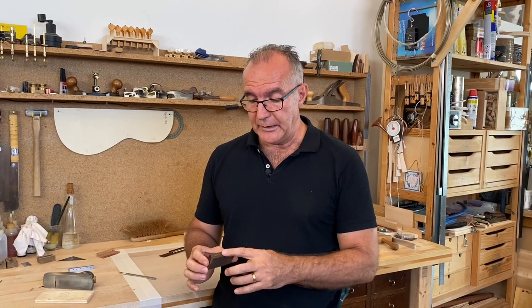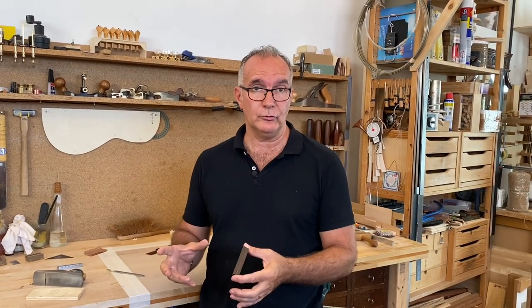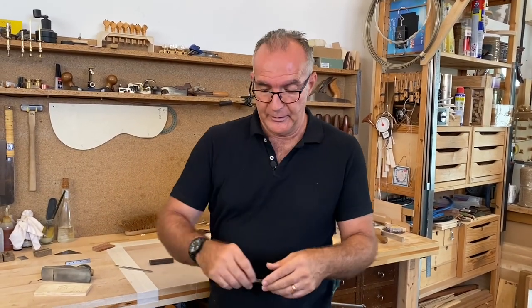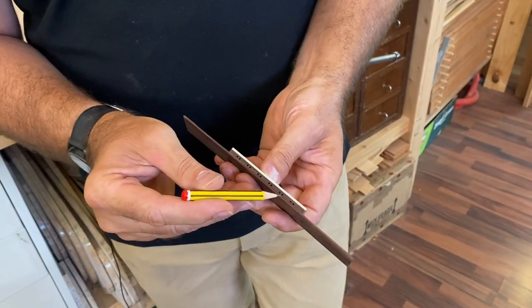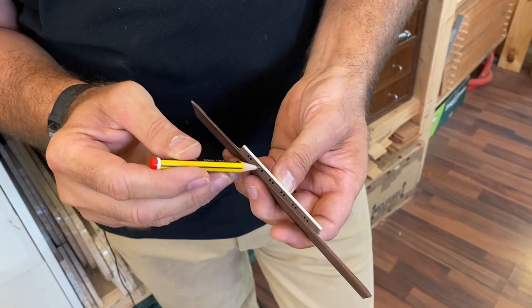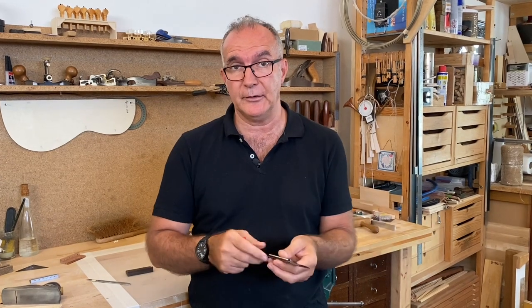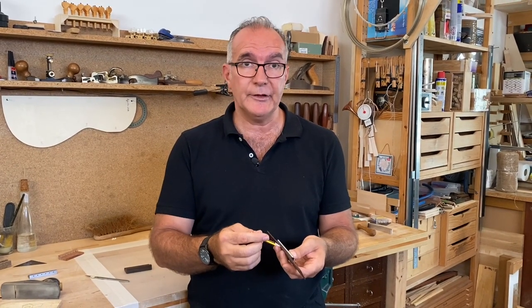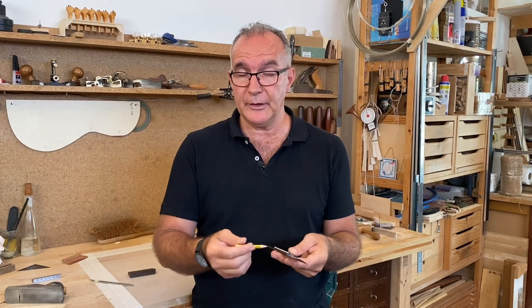And the other reason why I wanted to do this jig is because this is also what I use to be able to do a conversion from 6 holes to 12 holes on a guitar. So basically what that means is that if you can see this bridge, let me just get something to point with, I have 12 holes here, 2 holes for each string. And sometimes I am in a situation in which I have to drill another set of holes in a guitar that is already, you know, a guitar that is constructed, been used, but originally had only 6 holes, and for different reasons sometimes it's convenient to be able to have another hole to string it up in using that method.